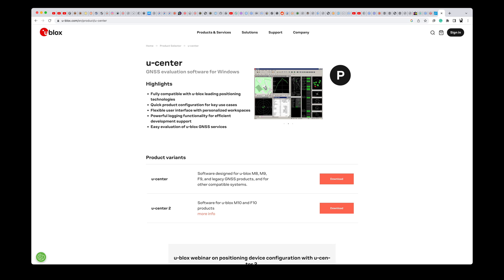I'll be checking that out in a later video when I rebuild my Chimera — the big quad that crashed and broke some motors. I've got new motors and also an M10 GPS to replace the old M8 one, and that quad always had a bit of a problem holding a lock when flying. The only other thing to check is your version of Betaflight: the M10 was developed for 4.5 and backported into 4.4 for auto-configuration. You may be able to use it in earlier versions, but you might need to go into the u-blox software uCenter and make changes manually on the GPS first. Some boards are backwards compatible with the M8 and some aren't — it seems a bit varied, but worth checking out.